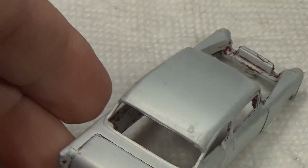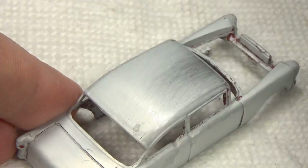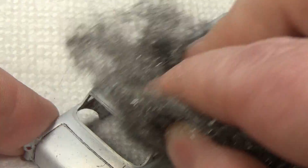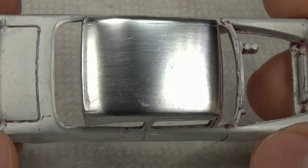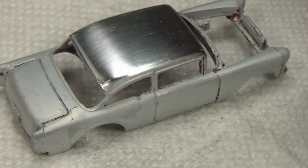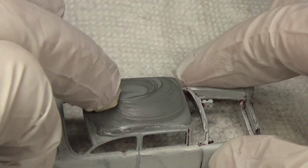Here I'm going to use the zinc plating as a filler for the really small scratches and pits that I couldn't remove from the body. I'm not going to bore you with the repetition. I plated this body 5 times, each at 30 minutes. After each plating session, I would remove the casting and go over it with some 4/0 steel wool to lightly sand out any plating imperfections. I did this for each session except the last.